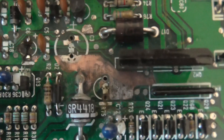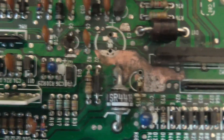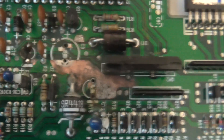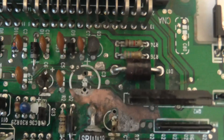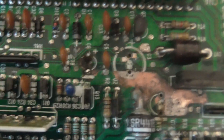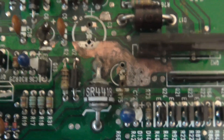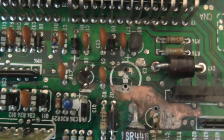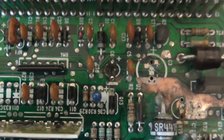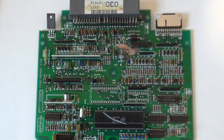This has taken quite a long time to scrape off the corrosion because the board has been conformal coated — you can see the shine on that single-in-line package there. So that's like a lacquer, and the electrolyte gets underneath the lacquer. The green is a solder resist mask that just exposes the pads themselves for solder, and it gets under the solder resist and tracks along, and will also start eating into the legs of the components around. So I've still got quite a bit of cleanup, and then some repairs, and then new capacitors to install, and then hopefully this will be a happy ECU again. We'll see you next time.